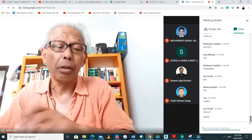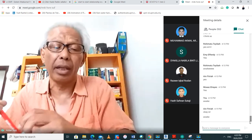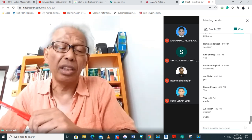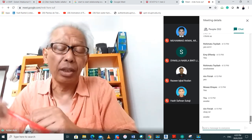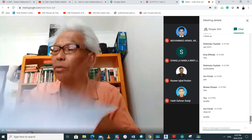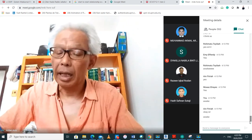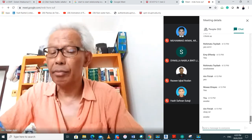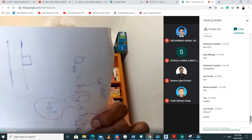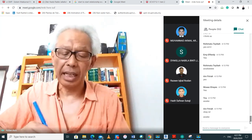All right. So as shown above for cohesionless soil, I'm on page 6. The load does not reduce linearly with depth. I already said that to you. Then the skin friction is not constant over depth D, but increases with increasing depth. For any depth Z in cohesionless soil, the skin friction is equal to sigma H tangent delta. Now, if I were to draw my pile, here's a pile and an element of soil just adjacent to my pile. You see that? So this skin friction is F sub S in that direction.